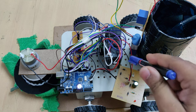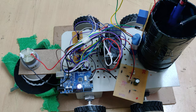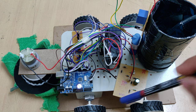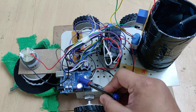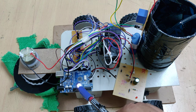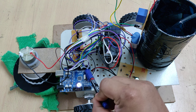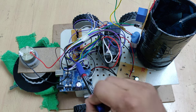We are using another battery to supply the water motor, which is used to supply water for floor cleaning. The Arduino uses an ATmega328 on-chip microcontroller, which is interfaced to the L293D motor driver. The relay and Bluetooth module are also connected to the Arduino.